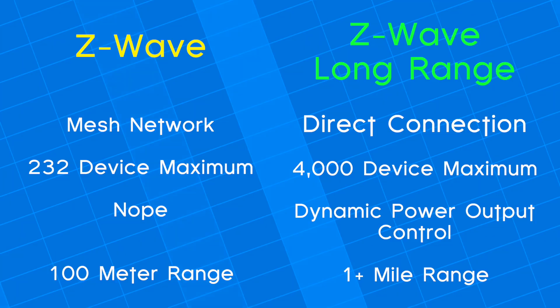Now that's all fun, but the real showstopper is of course the range. Z-Wave Long Range claims to have a theoretical range of several miles and a quote, proven transmissible distance of one mile direct line of sight has been achieved. Well, not by me it hasn't. I walked around with three different Z-Wave Long Range devices connected to my Hubitat Elevation C8 Pro Hub to find the limits of its range, and I didn't have to walk very far. The maximum distance I got was about 300 feet. Now that's much better than regular Z-Wave, but it's a far cry from a mile.